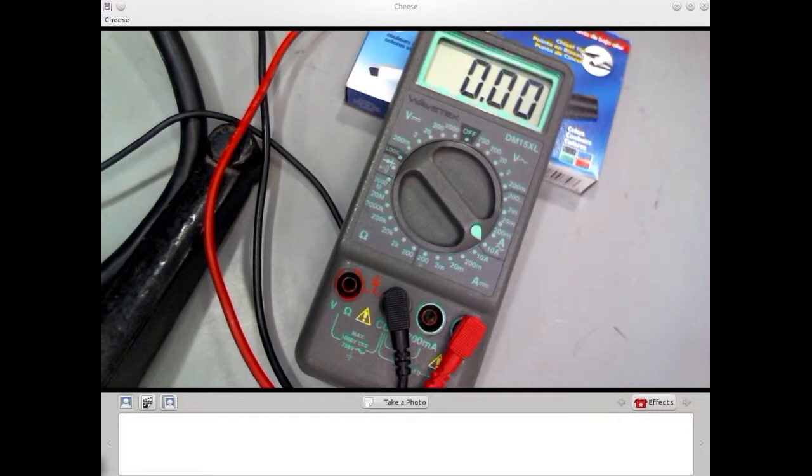Jasmine and Avery, what did you get for I1 — the current through the 100-watt bulb? 0.80 amps. Anyone want to confirm or refute? Confirmed. I2 — Jen and Emily, what did you get? 0.32 amps. Now let's do a test: conservation of charge dictates those numbers have to sum up to the total. Do they? Yes — 0.80 and 0.32 gives you 1.12, which is the calculated total. That's a cross-check. If those numbers don't add up, you've made a math mistake — everything was based on charge conservation and energy conservation.